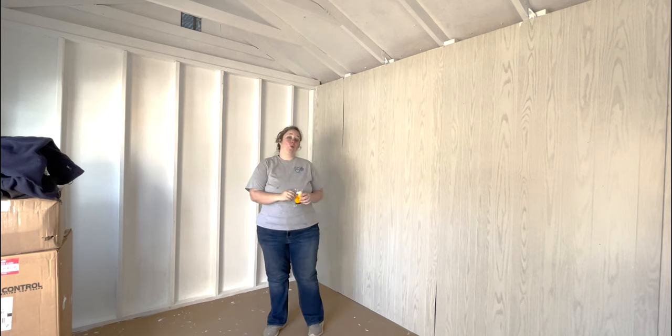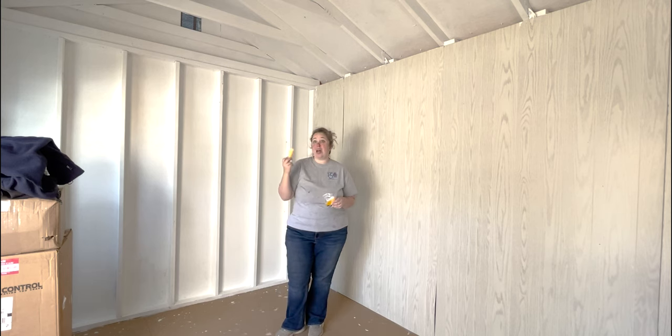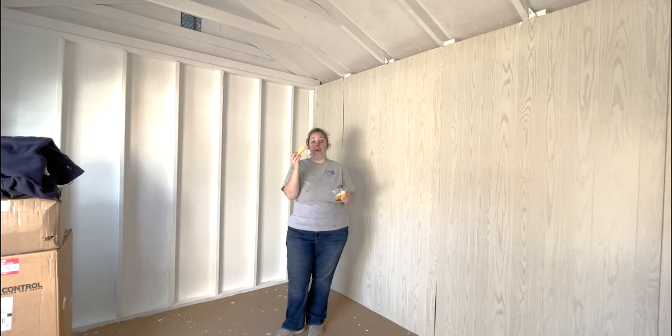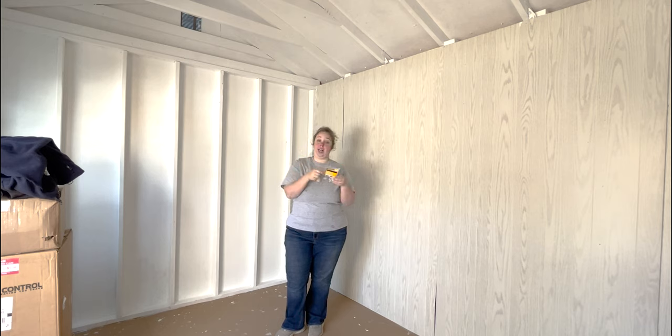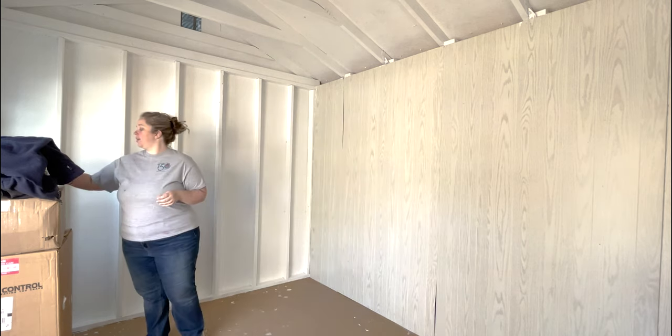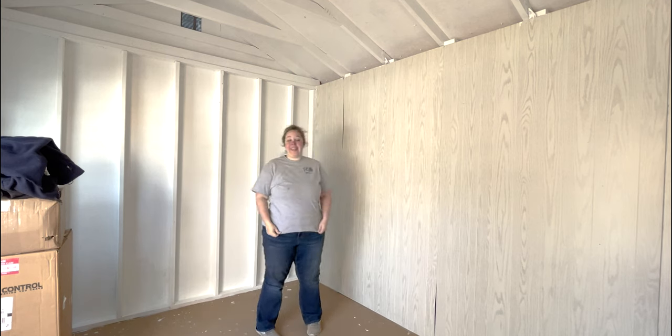We started with some foam rollers because I really like those for finished walls, but this is a shed. It is not a perfect shed. There are little nails and screws almost everywhere in the ceiling, not really in the walls, and they ate the foam up. So these are literally the cheapest little foam, or not foam, polyester knit rollers that you can get at Walmart. And we found that of all the roller naps I have, I worked at Sherwin-Williams for years, I have a lot of paint supplies, these work the best. Go figure. So, you know, sometimes back to basics is all you need.